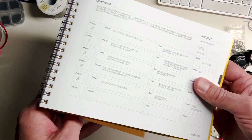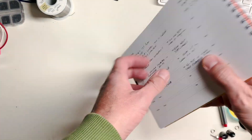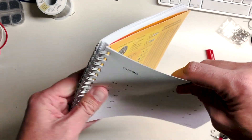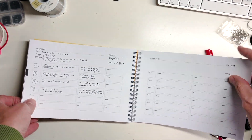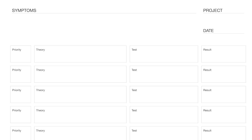At the back of the book is a section about troubleshooting. Whenever I make something it is very unusual that it actually works first time, and the way I generally troubleshoot is you kind of panic, try weird random things, and then you get really strange ideas about what might be wrong — like maybe all the resistors I bought are actually the wrong size. So what I've got here is a more rational, structured way of doing troubleshooting. It's a table you go through: you say what's wrong, what the problems might be. I've found that just sitting down and sensibly going through what you're trying to do, what you're seeing, and what tests you need to do is really helpful. Writing down on paper what you think is wrong, what you're expecting to happen, and what really happens is very helpful when troubleshooting.